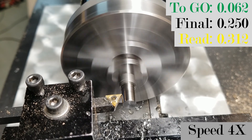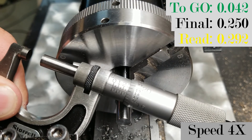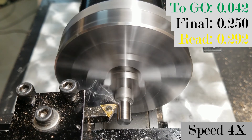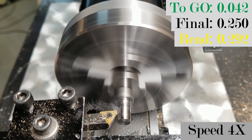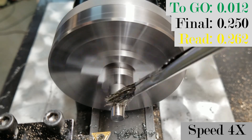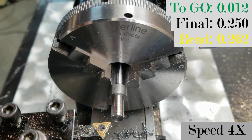I'm getting better — not great, but getting better. I took a little cut off and I'm going to check where I'm at. It's about 42 thousandths left to go — not bad. I'll take some more cuts with the carbide going in about 10 thousandths, then split off half of that — 12 thousandths off the diameter, or six thousandths off the radius. Check the temp — it's not great.